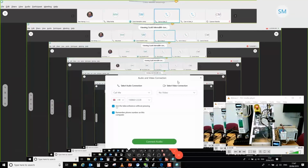So normally that's set up to 16 bits and that's essentially all that you need to do, because the other part of the output ratio, a number of encoder counts over a number of user units at the output, is all handled by the software. You don't actually have to do anything at all. It just manages it for you.